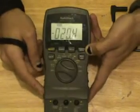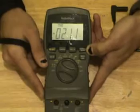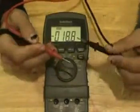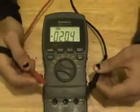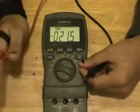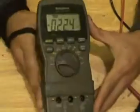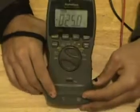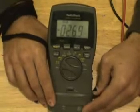Your multimeter will be a long-term investment. If you treat it properly and don't abuse it, it will last you longer than your kneecaps. As you saw from the last multimeter I showcased, it's very old and works brand new with no problems whatsoever. You want to keep your probes clean, sharp, and tidy — do not use them as tools, do not pry things apart with them. If you're going to look for a multimeter, make sure you have AC and DC voltage, capacitance (optional but I like it), resistance, current, and continuity, and make sure your probes are removable. Make sure the meter itself is fused — because there have been times I've lent my meter to friends and they put it on the wrong setting and fried my meter. Fuses are your friend.